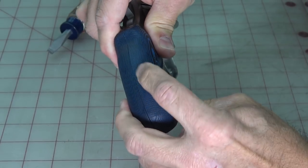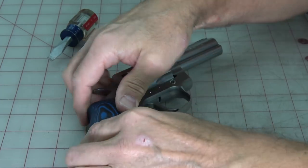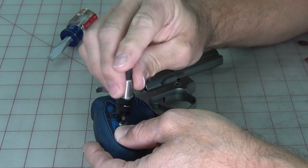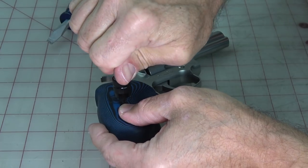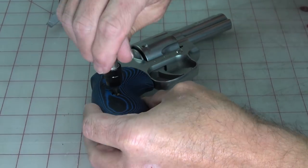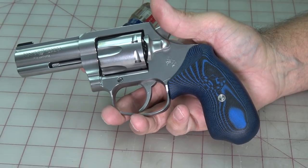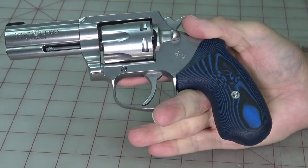It's not going to be absolutely zero gap, but you don't want it cockeyed where you can tell it didn't snap in place. Drop the screw through the grips. Hold the grips when you start tightening so you don't push the grip off with the screw. I don't have a handle on the Torx tool — that actually helps limit torque; with a handle you might apply too much. Tighten it to nice and snug with a reasonable amount of torque. You can see the screw shows through on the other side, and no Loctite is visible on the outside.